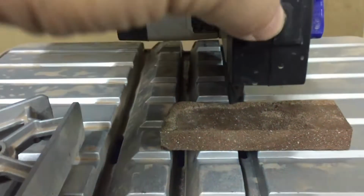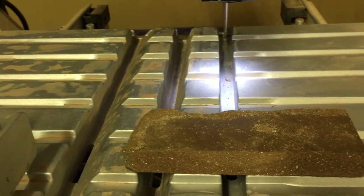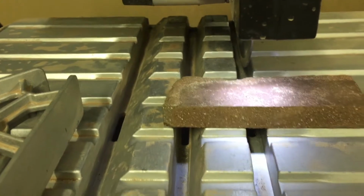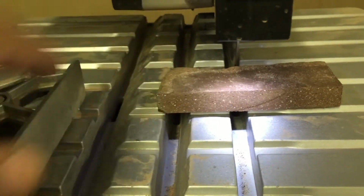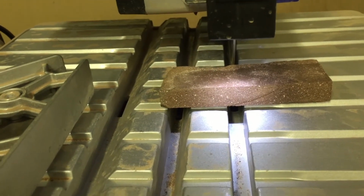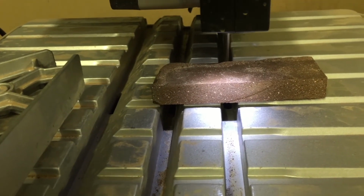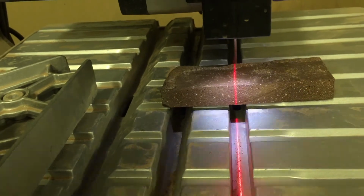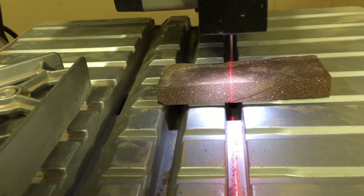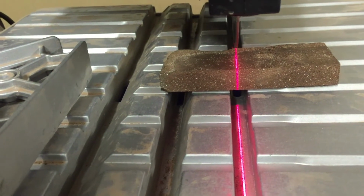The other tool that you have available is a little work light. What I found about the work light is it isn't super useful in that it doesn't shine on the work when it contacts the blade. You can see as the work moves through, the light hits it, but as you approach the blade, it gets darker and darker. So I didn't find that light super useful. The other thing it does is obscure your laser light if you're trying to use it, which tells me that out in bright sunlight, that laser light would probably go away completely. So that is what that is.